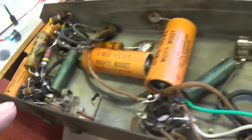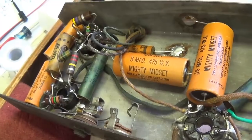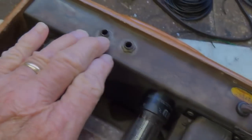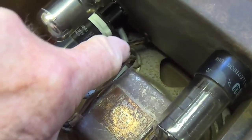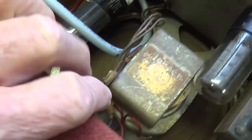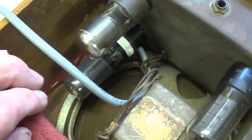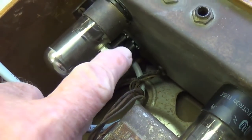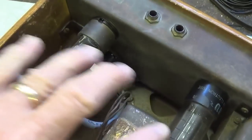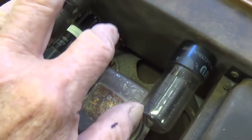Now let's turn it over and plug in the tubes, including that vintage 6V6 that we're going to use instead of the 6K6, which is a lower output tube that came with the amp. All right, the chassis has been reinstalled back in the cabinet. After doing so, I checked to make sure there are no bare wires anywhere near metal, no possible shorts in the harness that connects the electrodynamic speaker to the amp circuit. I installed a Eurotubes bias probe between the 6V6 and the tube socket. The original two tubes that came with the amp, a 6SJ7 and a 5Y3, are both installed.